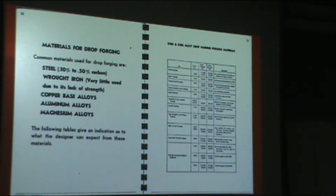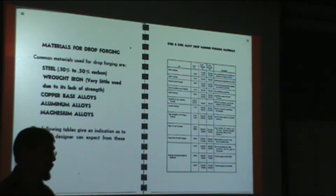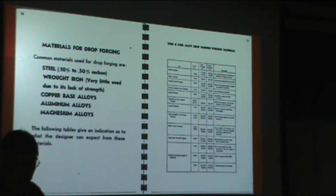Some of their equipment — they're known for having what's called a counter blow hammer. We'll see some regular hammers later, but in their particular situation they have a machine where both the ram and the anvil are in motion in opposite directions, meeting one another at a certain point. That's a kind of unique setup; there aren't very many of them. They're used for generating very high strain rates and very high loads to fill intricate cavities and make things that have very high flow stress.